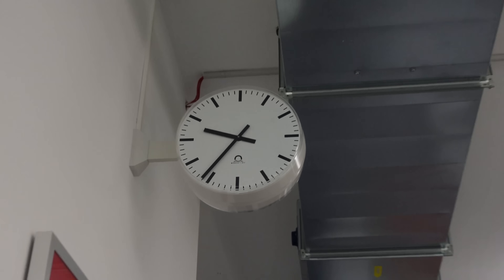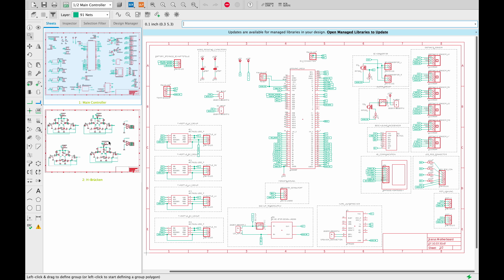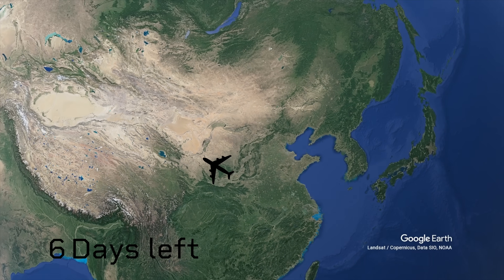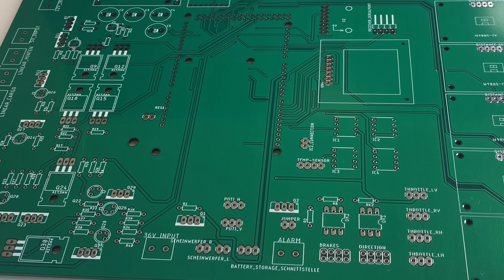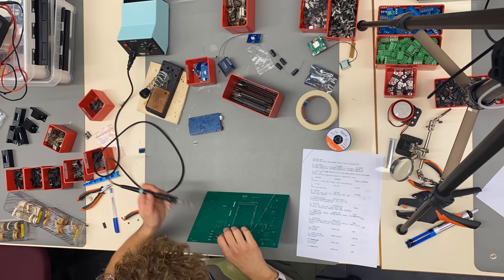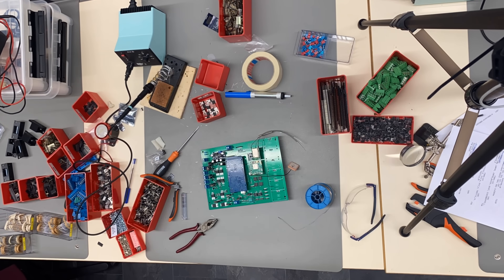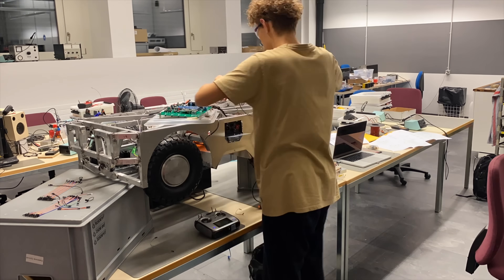The clock was ticking and I was still missing one crucial part: the motherboard. I fired up Eagle CAD software, threw all the needed components inside, connected them, and sent it off to China at 3am in the morning. I spent about 50 bucks on the four-day delivery from China — I had seven days to make that thing work. It's Monday morning, the package was delivered, and I immediately took the next train to the workshop and started soldering everything together. The shuttle is controlled with an Arduino Mega. The motherboard, while huge, seemed to work just fine, and I screwed it into the frame and started connecting all the cables together.